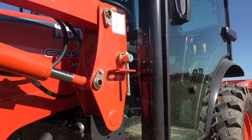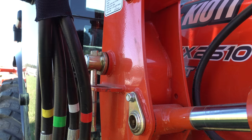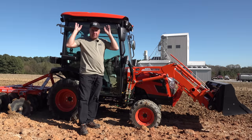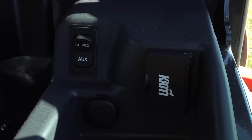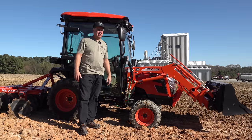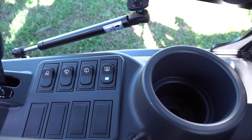I haven't used the loader at all yet. Like most loaders in this class, it uses a pin — you put the stands down, lift the loader to remove stress on the pin, pull the pin, lift it off, and back out. The loader uses a Skid Steer Quick Attach, which I believe is standard. Inside, speakers are standard, right up by your head. You can plug in your phone — iPhone, Android, whatever — and use those speakers. It does not have a hands-free microphone, so it's not Bluetooth capable, just cable. It'll also charge your phone with that same cable. Overall, a pretty nice cab for such a small tractor, but don't expect it to be as quiet as the more refined and isolated cabs in the higher series tractors.